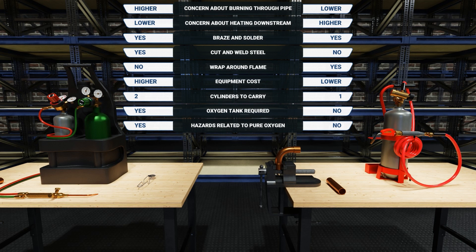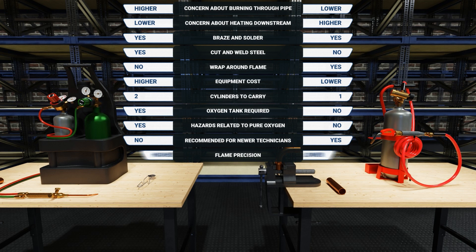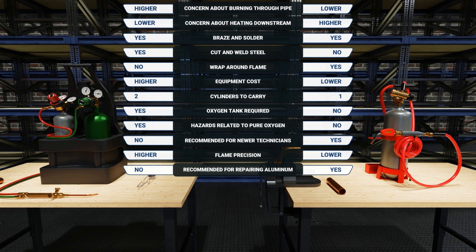You don't have to have a pressurized oxygen tank on your vehicle with air acetylene, which makes it safer. My recommendation is generally for newer technicians to begin to learn to braze using air acetylene, and that technicians use an oxygen acetylene rig when they need to work inside equipment where a more precise flame is needed — for example, brazing in an expansion valve or internal components of a system. I also recommend an air acetylene brazing rig with a 3 or 5 tip when repairing aluminum, as shown in a prior video.